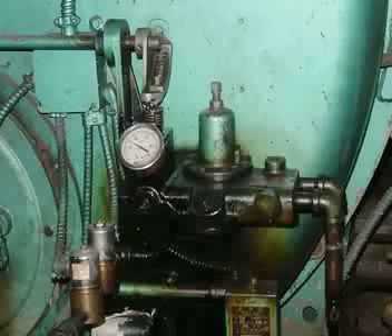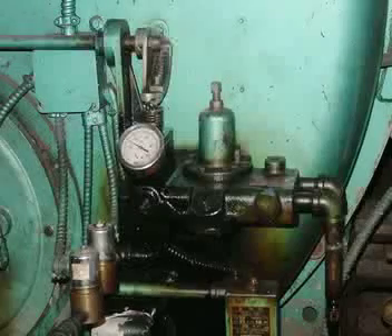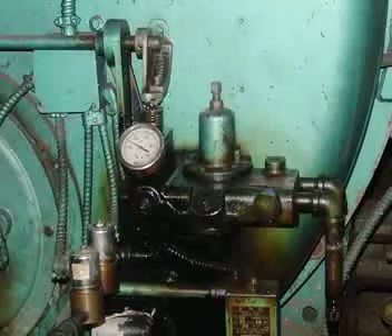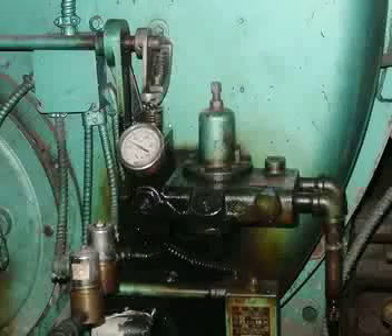There's a close-up shot of the oil metering valve with the characterizable trim. The reason for this close-up is that we're going to show another close-up in a few slides showing the servo attached to it with a field-developed bracket. You can see there are a number of set screws, which are adjusted during a tune-up to characterize the fuel-air ratio — so a person has a fair amount of mechanical work to do during initial setup.